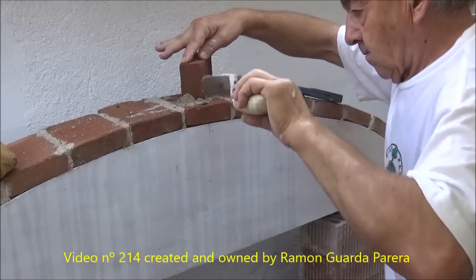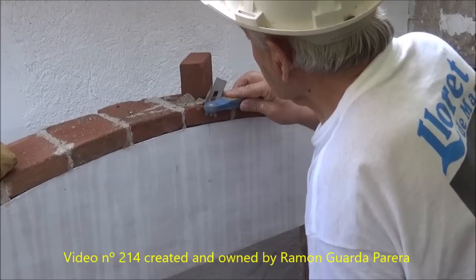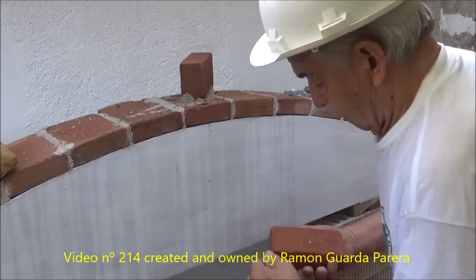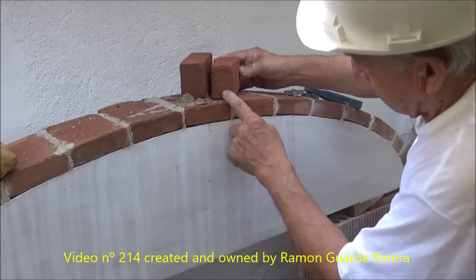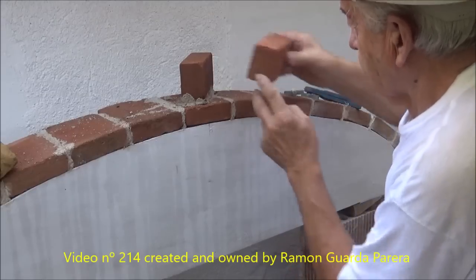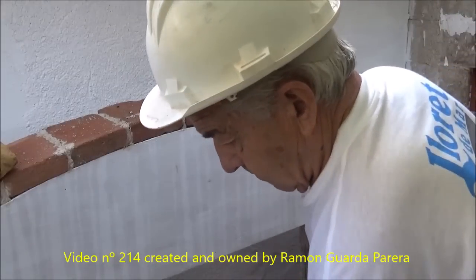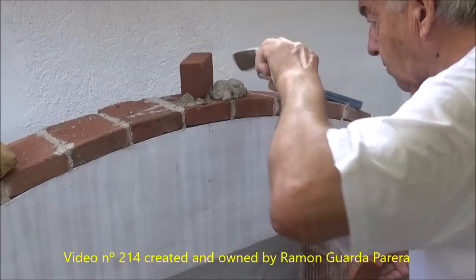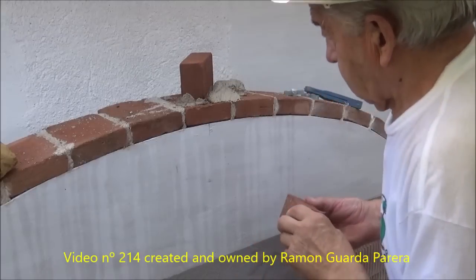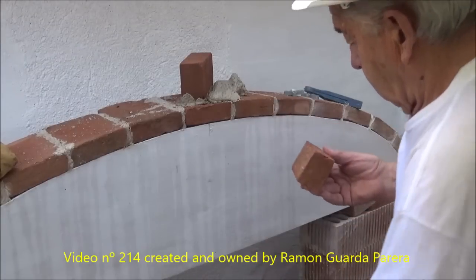We also use gauges or plastic guides for the joints, both vertical and horizontal. It can be guided by sight but it is more effective to use the separators. We present the second brick. This piece is easier than the first, but you have to try to place it as perfectly as possible, following the curvature of the arch. Keep in mind that the back of the piece is more to the right than the front, and therefore will be more inclined behind than ahead. Always follow the inclination of the arch. At the beginning it is a bit more difficult and the most complicated of all is the start of the extremes.